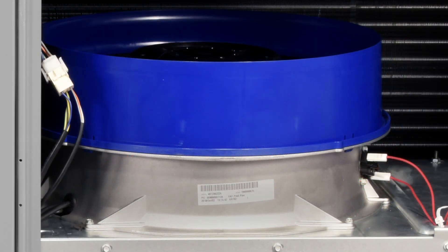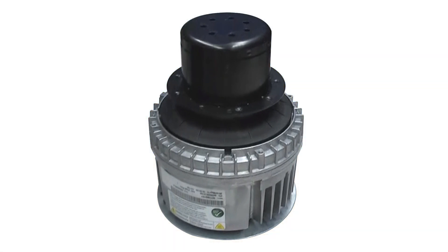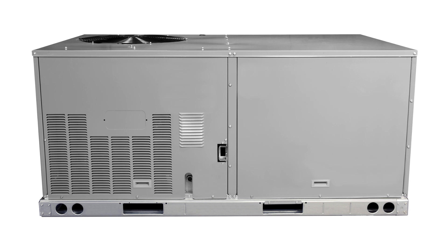The EcoBlue indoor fan is powered by an electronically commutated motor and controller. These two components are attached together as one assembly. This assembly is analyzed and serviced as a single piece — no further disassembly or servicing is required. Because the power leads are internally connected to the controller portion, motor lead resistance testing is not applicable. From here on, we will refer to the assembly as the motor.